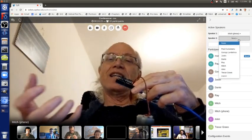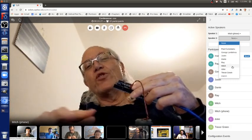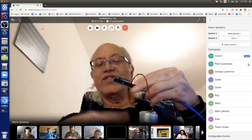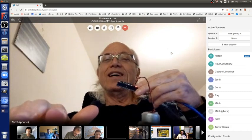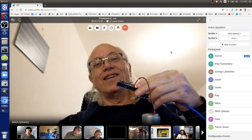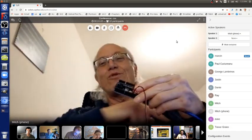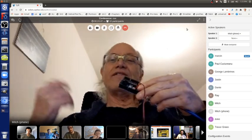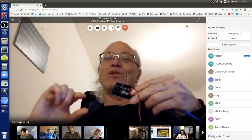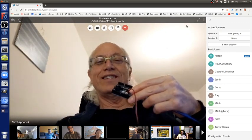on a robot with wheels. If I want to make the robot move forward, I turn both output pins on to make both motors spin at the same rate, and then the robot will go forward. If I turn only one motor on, the robot will turn right. If I turn only the other motor on, the robot will turn left. If I turn them both off, the robot stops. And so a simple robot controller is actually a hack of Hello World.